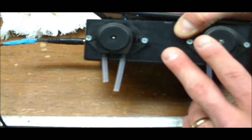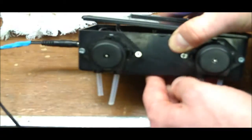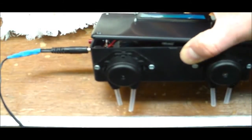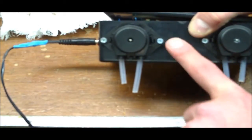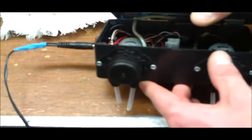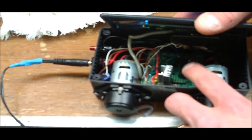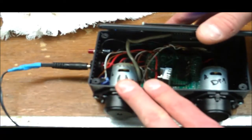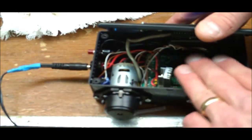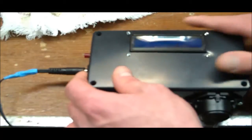Looking back, I'm glad I went with two pumps. It's common to run master and slave configurations for dosing pumps. I'll probably get two or three more peristaltic pumps, get another identical box, stack them, and run wires down from this master box. I'll make a small board with just the MOSFETs, bring 12 volts power, ground, and the Arduino control signal down via three wires.